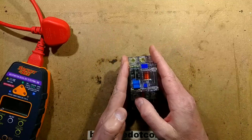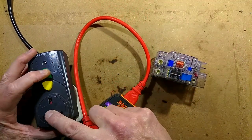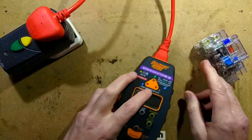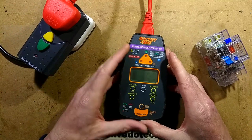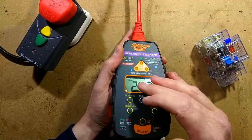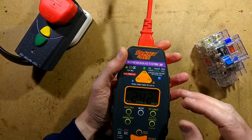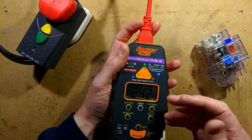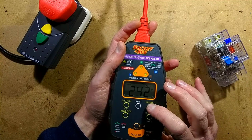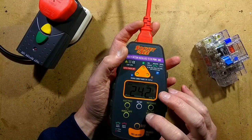It's notable you can separate these, and I have had them apart. But before I take them apart, let's test it. I've got an RCD tester here, and here is the RCD set for 30 milliamps — my other one in line is 100 milliamps. The tester has an LCD display that goes right up to the edge, which makes it hard to read. I can select the trip current as being 30 milliamp or 100 milliamp, and select whether it tests at half, five times, or one times the trip current.